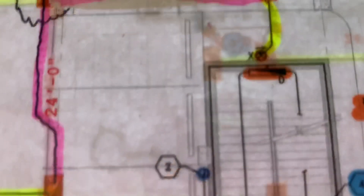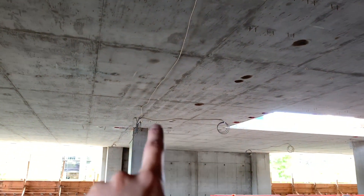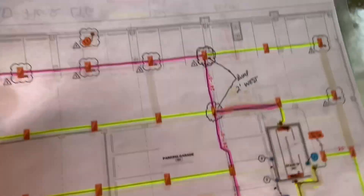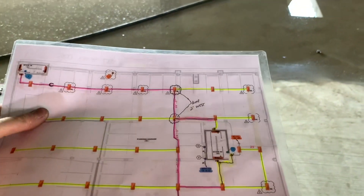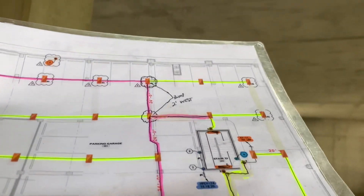This one is going to the exit sign right there — that's where we're standing. There are four of them here; this last one is emergency going right there, and then it goes to 12-2 and then another 12-2. If you just look at that and line yourself up in the right direction, you basically look up on the ceiling once you've got it going the right direction. The pink line is the 12-3, and then two yellow ones.